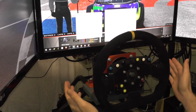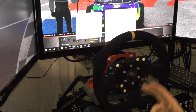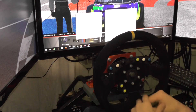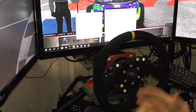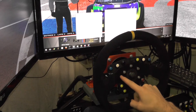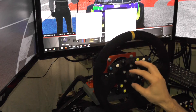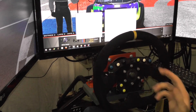Here's another update — this time it's about the actual button box, or in this case just a faceplate. I'm probably not going to create a back body for it because that would add extra weight, which counteracts the force feedback. It's not going to be an issue with a direct drive wheel, but why waste it? The wires run right across here, and the Arduino Nano is sitting right behind here in a little wire channel, so it's all held in and doesn't come loose even with strong force feedback.